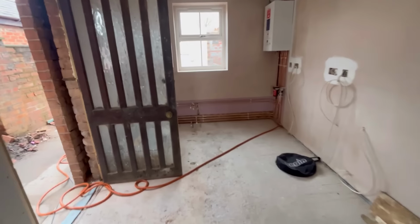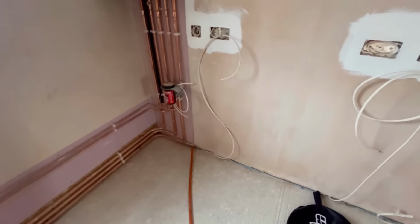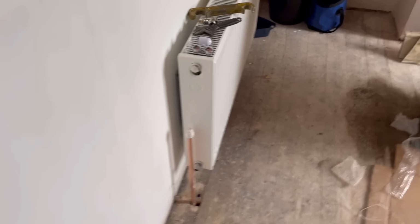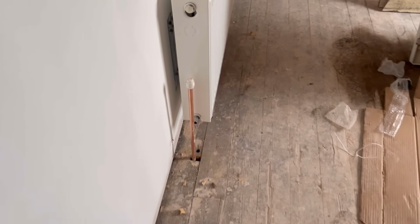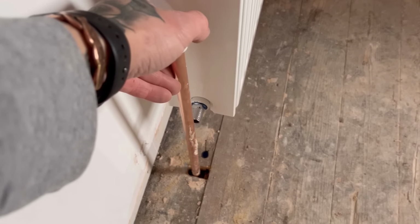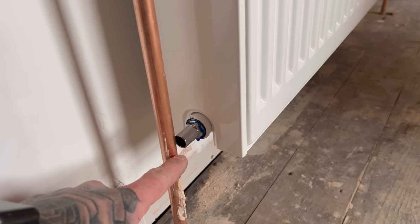He's not got the plinth heater yet, but I can't really do anything with that for now. Got lucky and all pipe centres had stayed in the right positions. Normally the plasterers move them or they become unlevel, but I got lucky on that one. So these should be a damn sight easier, although they're not as aesthetically pleasing because they come out of the floor and not out of the wall, but it's what the customer wanted, plus it's cheaper labour-wise. So basically it's just cutting them off straight in for 1, 2 and 3 in the loft.